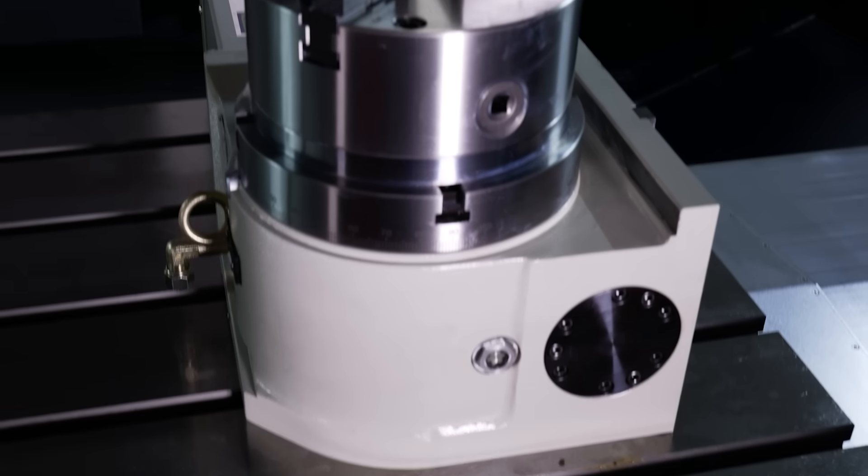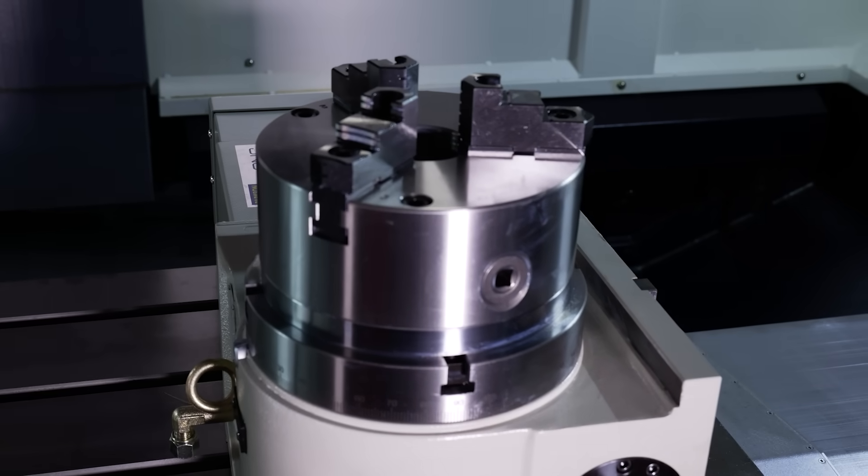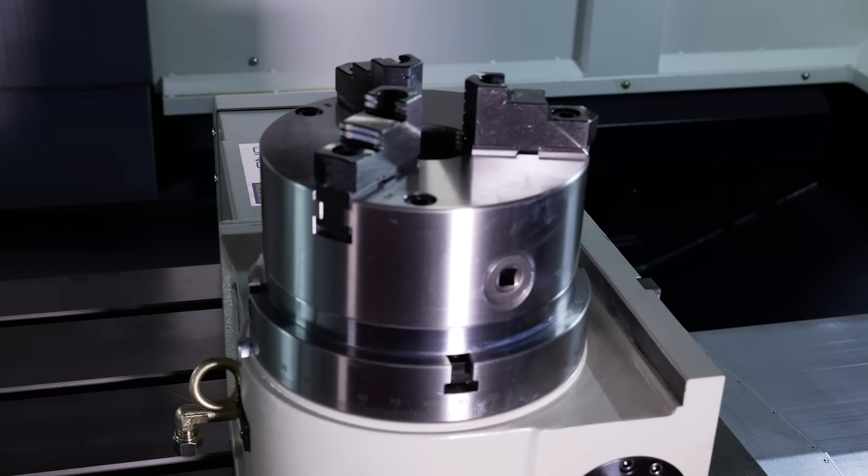Obviously, we forgot something here — how are we connecting these to the machine? Well, to open up the question a little bit, we can have typically pneumatic and hydraulic clamping on these tables. Hydraulic clamping is the preferable version because it's three times more powerful than pneumatic. So to encompass that feature across the full range of tables on all machines that we sell, we include in our package an air oil intensifier, and that gives us hydraulic clamping for every size of table.